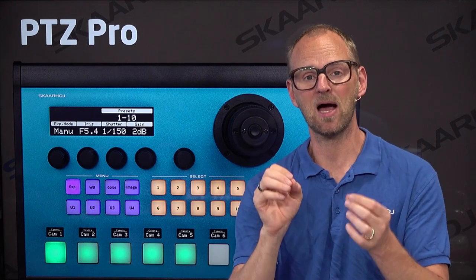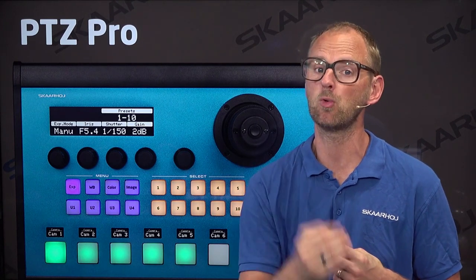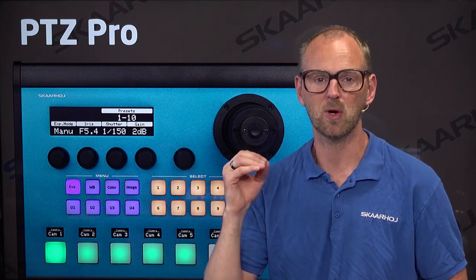Keep in mind that this is our approach to cameras. We already do the pan-tilt-zoom control of the BirdDog camera, but we are not happy with only doing that. We want to access parameters like red and blue gain in the white balance setting. We want to know exactly what features are in the camera and make sure they are broken out onto the displays in the menu on the PDC Pro.